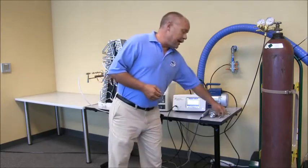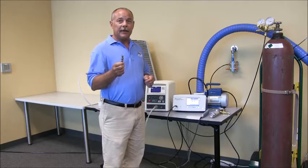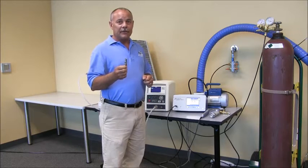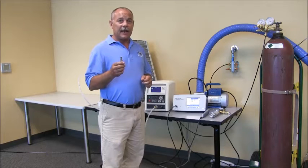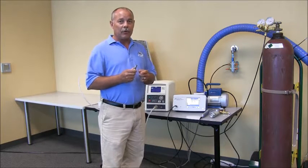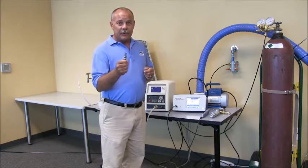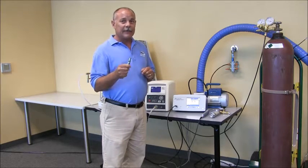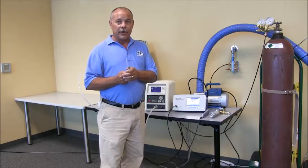To simulate a leak into this product, I have a 200cc per minute leak. That's a large leak — I would consider that a gross leak, the type detectable with a quick vacuum or pressure decay typically used for this process. That's 200cc per minute nitrogen with one atmosphere differential, which equates to thousands of ounces per year.